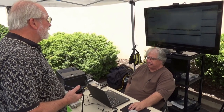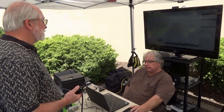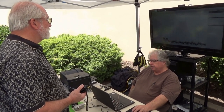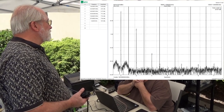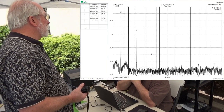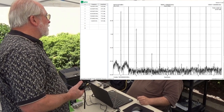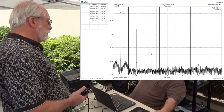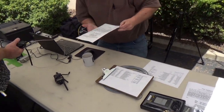All right, let's get down to the nitty-gritty — let's take a look at our harmonics. Go ahead and key and hold it down, do a few passes, let it stabilize. You see that second harmonic? And actually the third one's too high too. Number one is the native frequency at 37 dB, and if you look at the next harmonic it's at 20 dB — so it's only down 17. Yeah, not all that great. Fortunately I don't care about 292 MHz — but there's the compliance data.